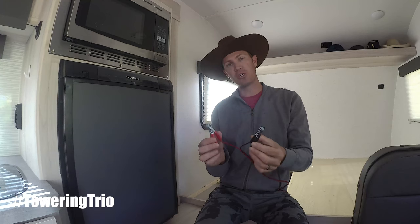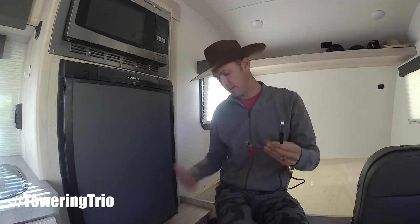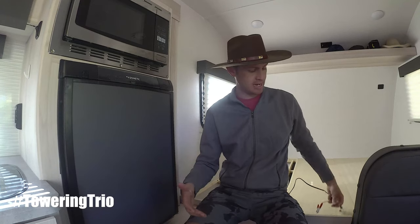From here, to show you how this works, I'm going to cause an error code and the furnace will shut down and stop blowing hot air. In about 10 seconds, it'll realize the connection is open and the control board will shut down the furnace.